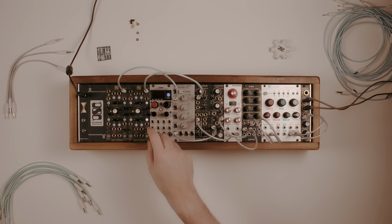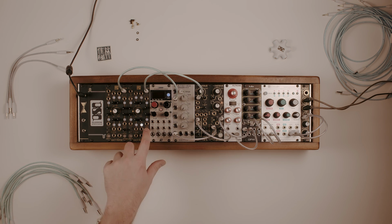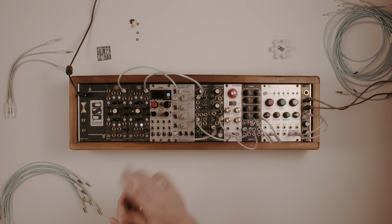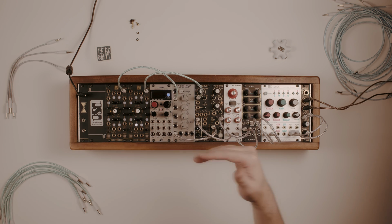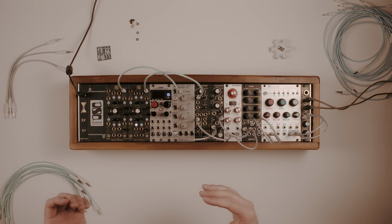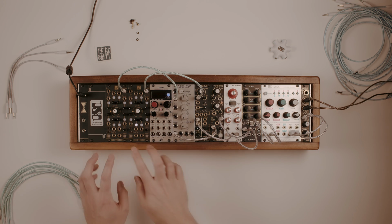Cool, so that is our manual bias, which takes a bit of manual tuning, but it means you're free to dial that into any fixed interval. If I change this toggle switch to the left position, this does it in a slightly different way. So it's still applying a bias, an offset, but it's applying it under the hood internally, summing with the step voltage amplitude before the quantiser. So this means I'm able to push this voltage up and essentially hit other quantization thresholds.